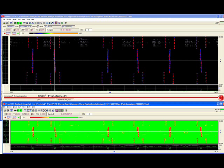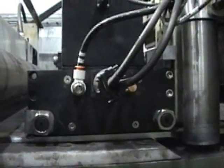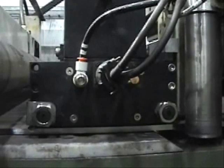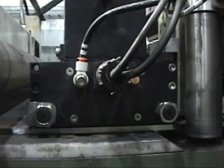The PI software performs simultaneous real-time data acquisition and analysis of ultrasonic signals, including real-time A-scan display mode available for ultrasonic setup and diagnostics, and C-scan mapping showing location of defects across the width and along the length of the plate.